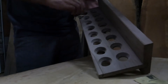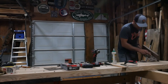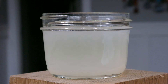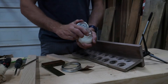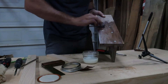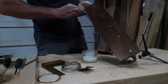One of the last steps is to hand sand the edges and the holes we drilled and remove any glue we missed, as the glue will stand out like a sore thumb if we apply a finish over it. Getting a recipe from Will Walker Company, I boiled some mineral oil and pure beeswax and let it cool overnight. The next day I started applying it to the piece. I chose beeswax and mineral oil because it's non-toxic and lets me keep my peace of mind when food touches it. It could be overkill for eggs since they have a shell, but I'd rather not risk it.